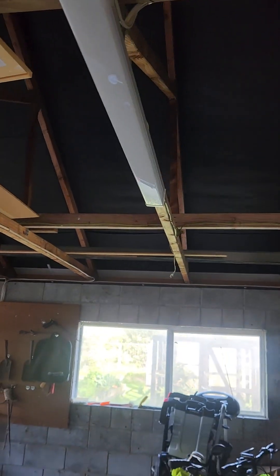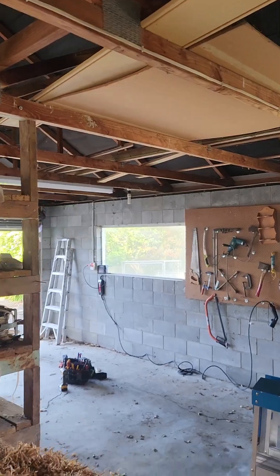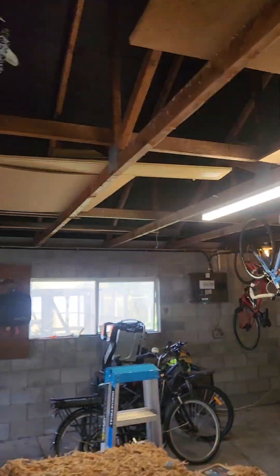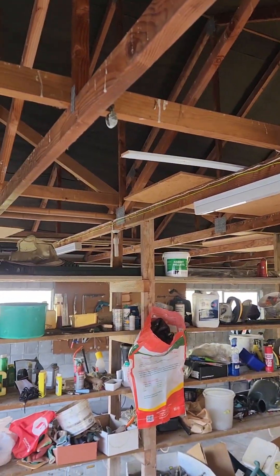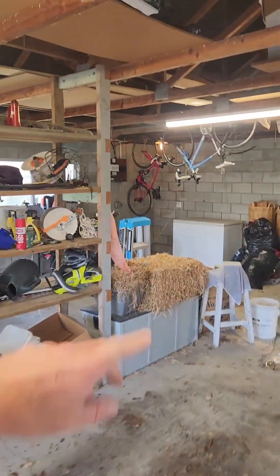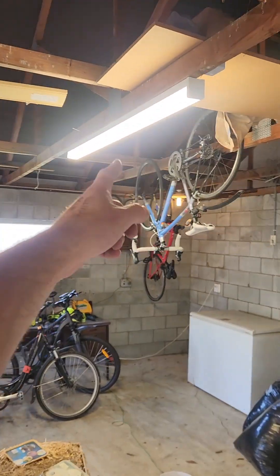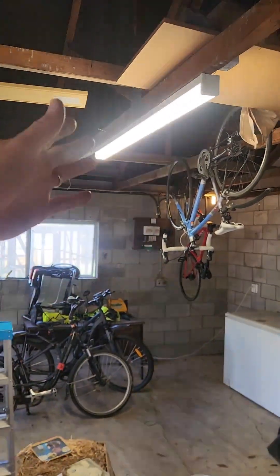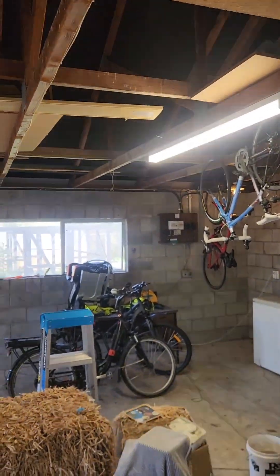We're all done, I've tested it, our earth's all sweet. Take that old light down over there and we'll give it a go — boom, there's one! Heaps better now. Mind the flashing on the board — I haven't added an RCD because this is a light replacement and I'm not running any lighting cables back to there. Yes, I ran an earth, but that is not the main control wires for the lighting — as per the regs, you don't have to put an RCD in the board.